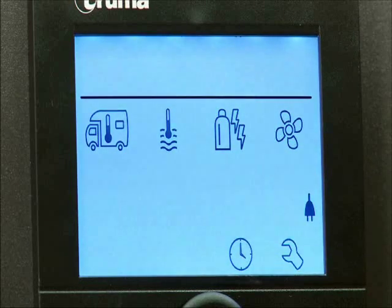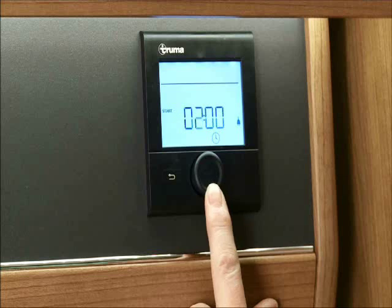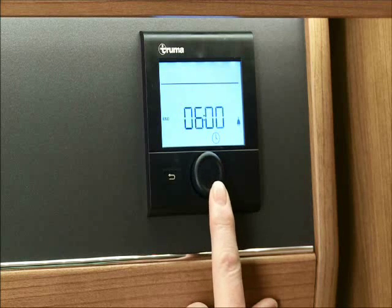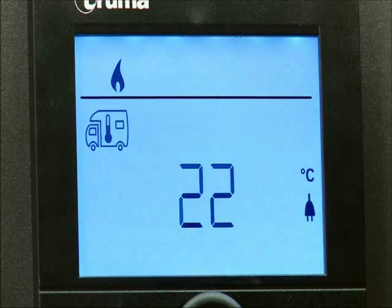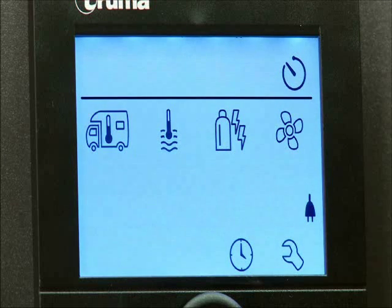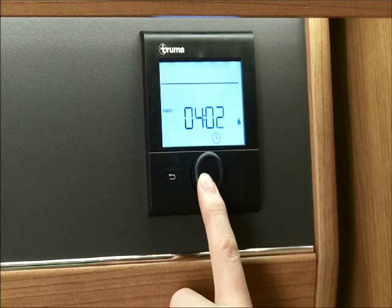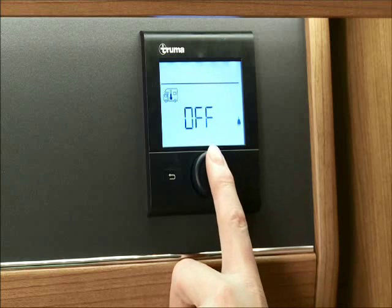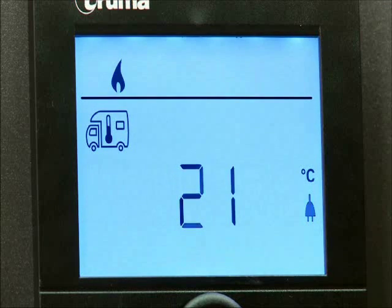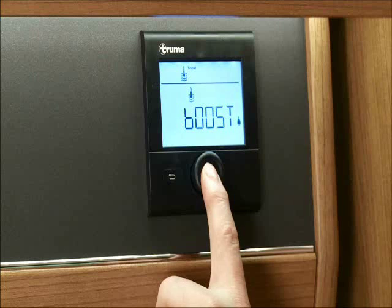The first symbol on the bottom row is the timer option. This can only be selected if the time has been set first on the control panel. You can activate the time switch with the central control knob, firstly setting the start then end times and then pressing the control knob to confirm. The time switch will remain active for several days until it is deactivated again using the same format. When the time switch has been activated, the switch icon will flash to demonstrate this. At this point you will need to go into settings to decide what functions you want the timer to control. The options are heating either off completely or set the temperature, then decide on your hot water which offers the option for water off, 40 degrees, 60 degrees, or boost. Then select confirm.